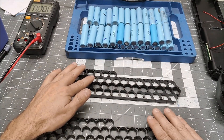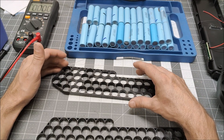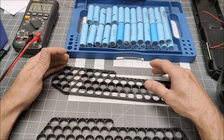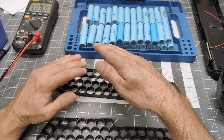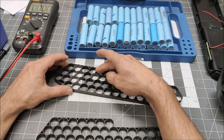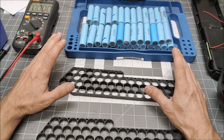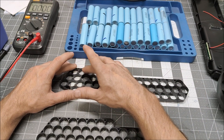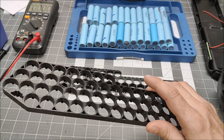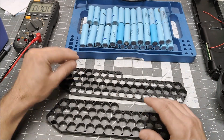Let's begin assembling the pack. When you place your cells, think about how you're going to do the spot welding — you want to make the least complex shapes you can, because putting nickel on top of nickel on top of nickel weakens the joint. If you can do one nice single piece of nickel joining the cells, that is the simplest approach. You're putting a lot of current through a single piece of nickel, but as long as this isn't a crazy high-powered battery, it is the simplest method.